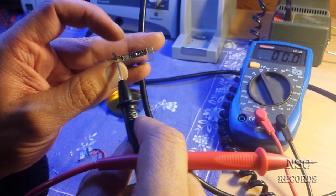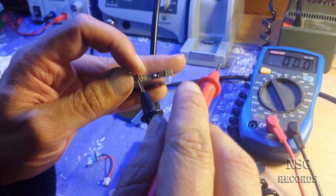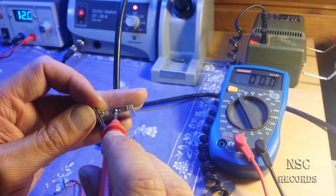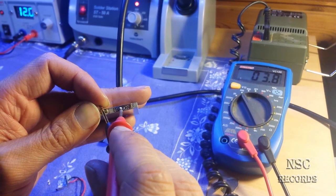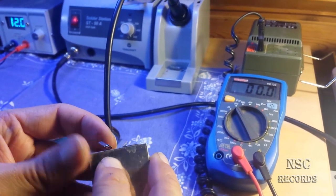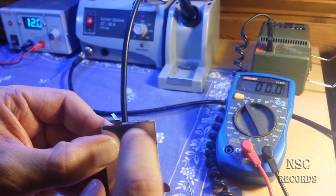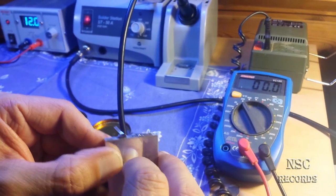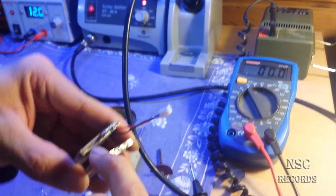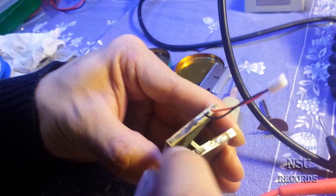The battery light is just off now but that's no problem. I will not try to hold it like that again. The multimeter shows 3.8 to 3.9 volts — that doesn't matter. You know the left side is also minus. Now you need to put some contacts over there — add some flux so the solder will hold really great, then press it on.